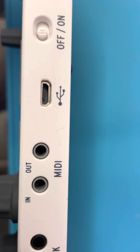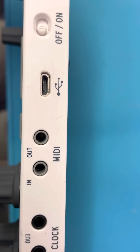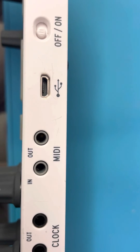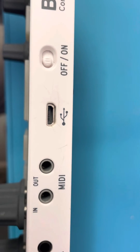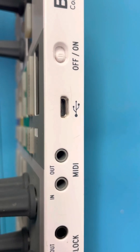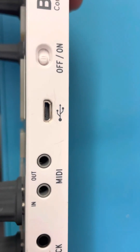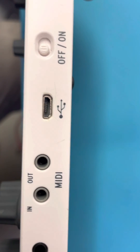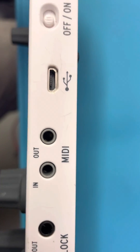It's been working great — you can wiggle the thing around and it won't actually lose power or connection to the computer. It's a fairly straightforward process; you just need soldering skills. The micro connections are fairly small, so make sure you check for shorts once you've finished the job. It's almost a one-to-one fit. Cheers.